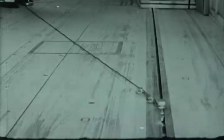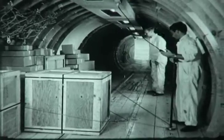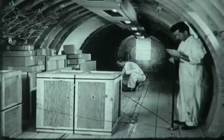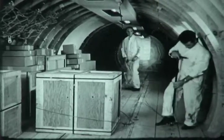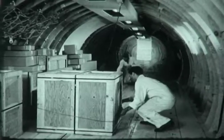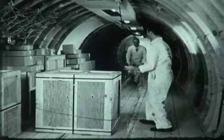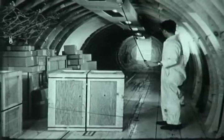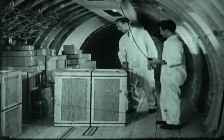This shows how the cable is looped over a moving chock of the Aerotrusty conveyor. These chocks, called donkeys, may be positioned wherever desired in the endless chain-link conveyor which runs beneath the floor channel. In response to the conveyor's pull on the cable, the heavy box slides out to the center of the cabin without disturbing cargo on either side of it. Now the cable is disengaged from the pogo stick, giving the conveyor a straightaway pull on the box in order to move it to the rear cargo door opening. Notice that no manual effort is required from any member of the crew, except for steering direction of the box.